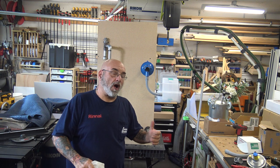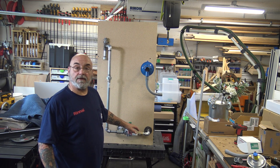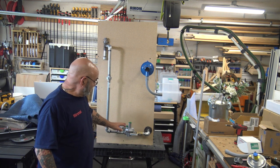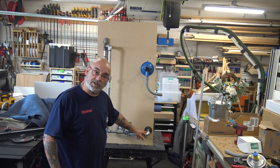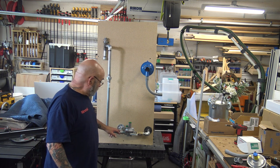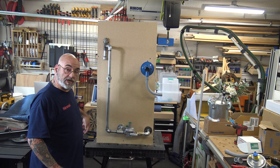Now, on large equipment like that, you might have, say, 10 pounds feeding this. And it could be, say, 1.25 inches. But the generator is 2 inch. You're going to get the size regulator for the size of the inlet of the appliance. Even though this is going to be registering at, say, 10 pounds, 5 pounds coming into the regulator, you need that full pipe. So we needed 12 feet of 2-inch pipe to get to that generator.